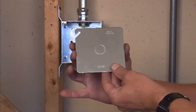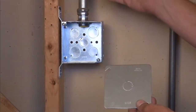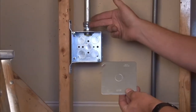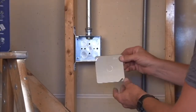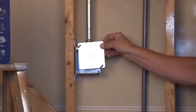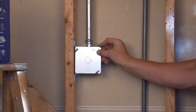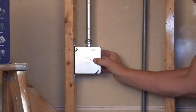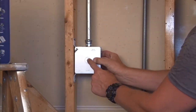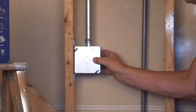This is when an installer wants to branch off inbound circuits and possibly bring them out the front of the box at a later date. You simply align the quick mounting tabs with the box screws, secure it down, punch out the knockout and you're ready for your next half inch conduit run.